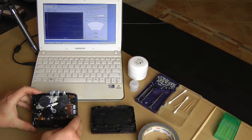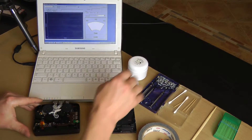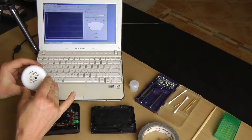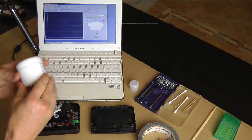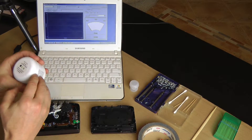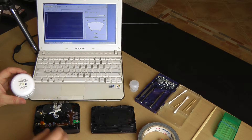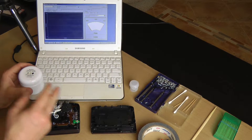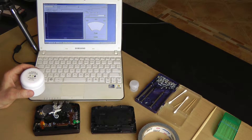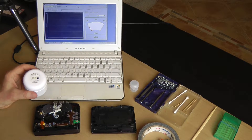After I cleaned up this gear, I'm going to put some of this synthetic lubricant. This one is Molykote, which is one of the lubricants, as far as I know, compatible with plastic. Not all lubricants are compatible with plastic. You cannot put regular grease that you use for cars, for example, because all these plastic parts will basically turn to goo.